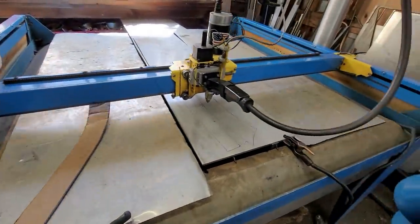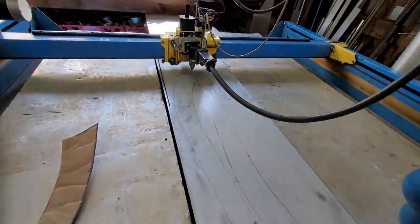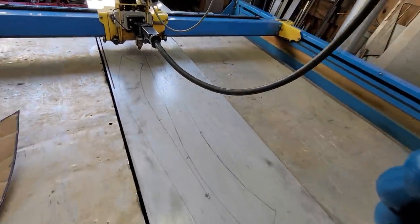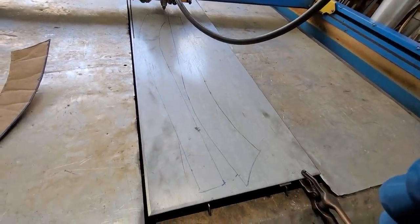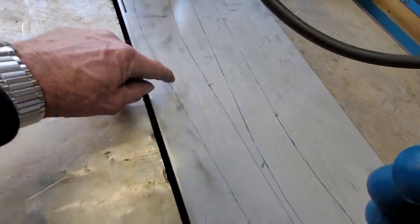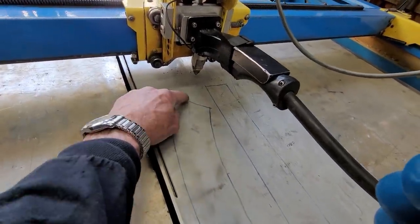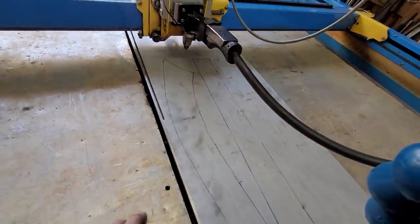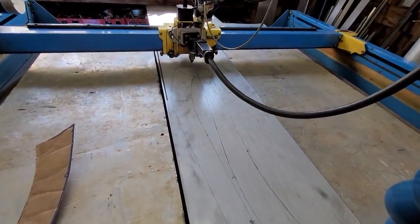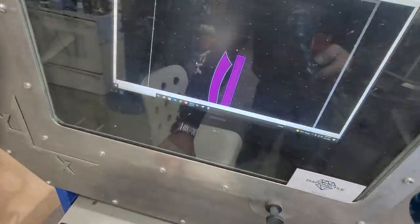So we drew them on here by taking our special little pointer that we have right there and pinpointing on our little sketches here a couple points. We basically put a point here, a point there. We come straight on two different areas. There's a point there, and somewhere in here we put a point. And then we hit the points up there and there. And then all we needed was a midpoint on each of our curves, and then we just use the spline setting and pick those dimensions between the straights and the points there. And we come out with the two shapes on the screen.